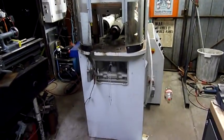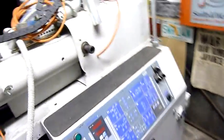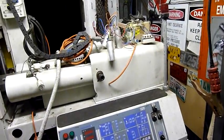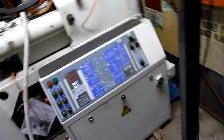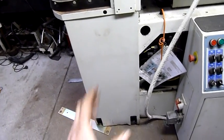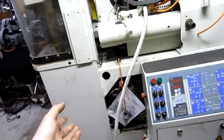All right, we're in, and the shed already looks smaller with this in place. It's a very big machine — well, it's tiny compared with injection moulders, but it's big enough for this shed. I'm going to lift the back up from its original chain points, get those blocks of wood out of there, and get rid of that steel sheet and the small timbers jammed underneath. I'll put jacking screws back in there with aluminium pads, then jack it up high enough to get a hardwood timber underneath and skid it around.